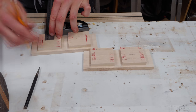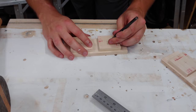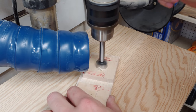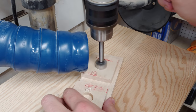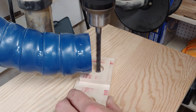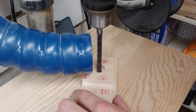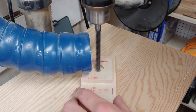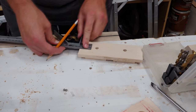I then mark the center for two holes in each side piece and center punch my hole location. I start with a seven-eighths inch Forstner bit, which will hold an R6-2RS bearing in place and sit flush against the board. I then drill out a 25/64-inch hole for clearance of a three-eighths inch dowel. The two holes on the left side are blind holes that don't go through, and the two on the right go all the way through.